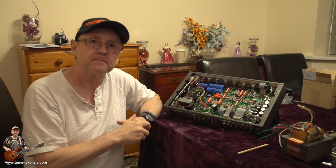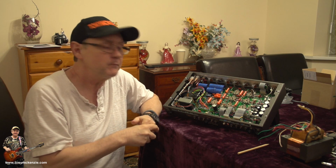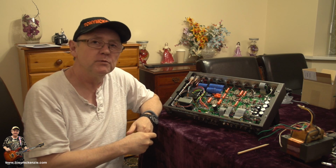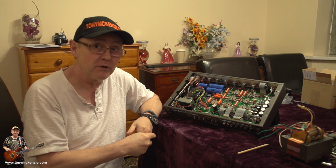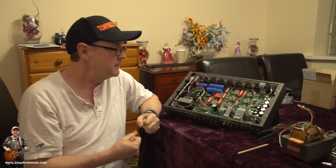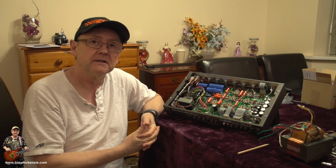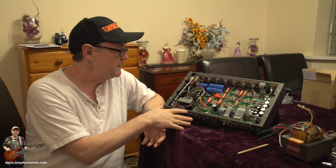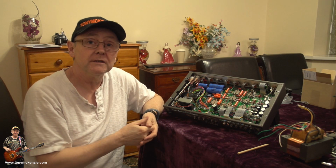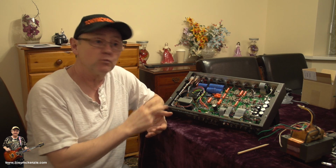And we can turn on and make sure you've got that other thing on your speaker connector or a speaker cab. And you just turn it on quickly. And if that light bulb goes very, very bright, turn it really off really quickly. And I mean quickly, because what will be happening is there'll be an excessive amount of current being drawn for some reason. And in a situation where the amp isn't actually doing anything, it's on standby, really the current should be very low. Now you can put an ammeter in and watch the current that way.